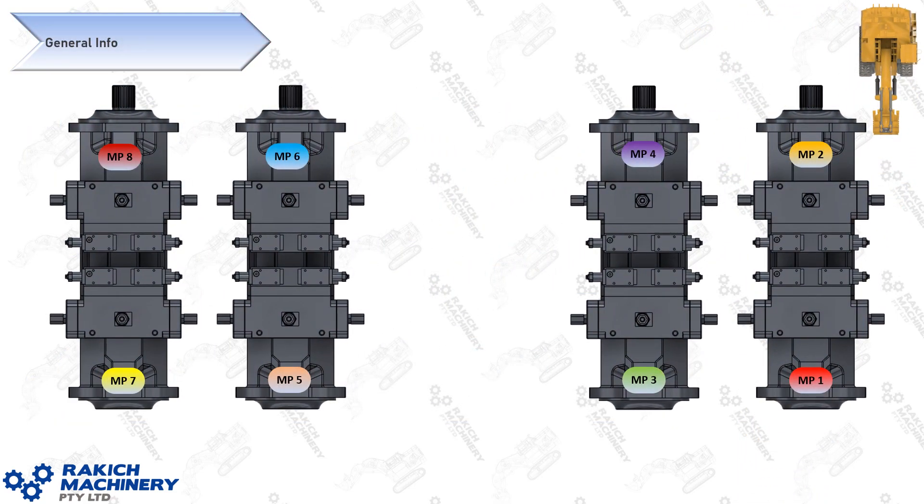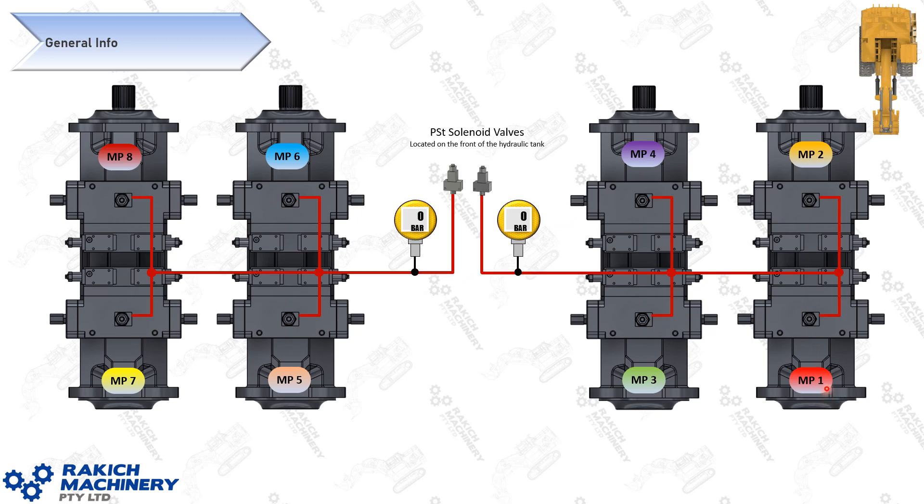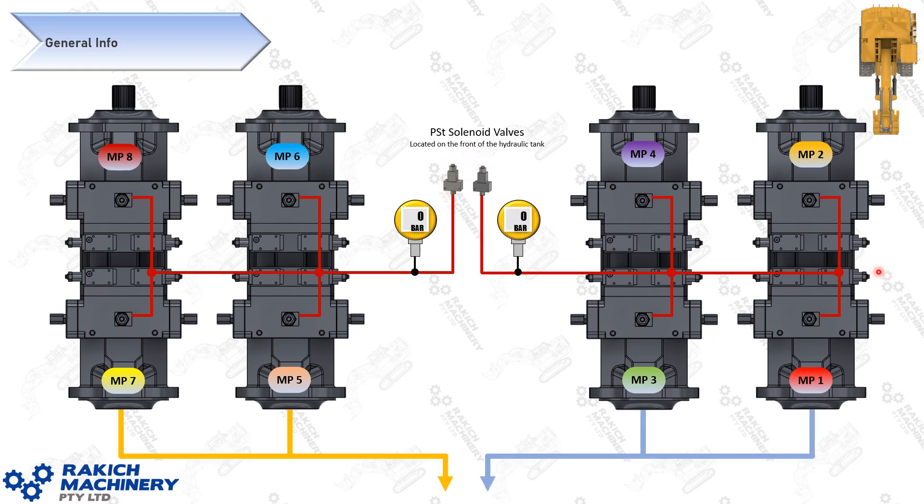Some orientation for the presentation. We'll be viewing the pumps in a number of slides looking from above, with the front of the machine at the bottom of the slide and the main pump numbering convention starting at the front left pump. Odd numbers are all to the front of the machine. I'll also be using a diagram showing the PST solenoids and their input into the pumps. For pump outputs, I've used basic line diagrams — for example showing main pumps five and six combined here, though in reality five and six don't combine on the machine.